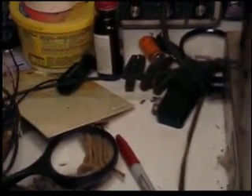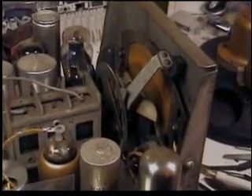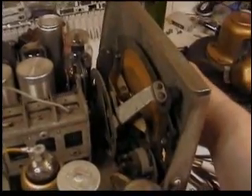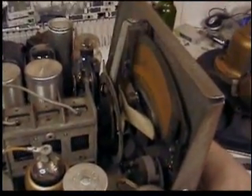I think I'm pretty well done with this. I need to do some testing. There's a whole bunch of caps and other parts that have been replaced. I also added this wire, removing the other wire they had in there. They had some twisted pair in there that was actually shorting out part of the signal — whoever worked on it before. But here is the tuning, which is pretty neat. That's a nice big old dial. This radio is about 1936 — the Atwater Kent 487.